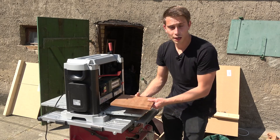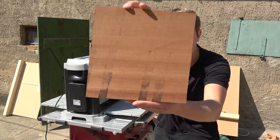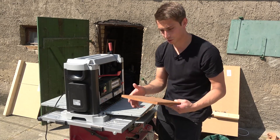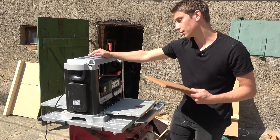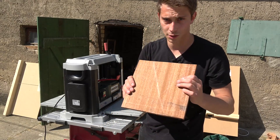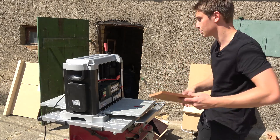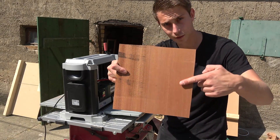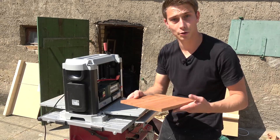For my projects on Stammerge EU I use a lot of mahogany wood, and when I receive it from the manufacturer it has saw marks all over it. I can use the random orbital sander to get rid of them but it takes a while. Let's see how it works on the thickness planer. Always go with the grain — never against the grain. I'm pretty certain the world would explode if I went against the grain. Let's take off just a tiny bit first. Most of the saw marks on this side actually came off, so let's run it through one more time.